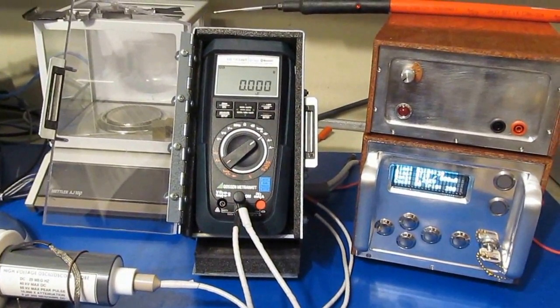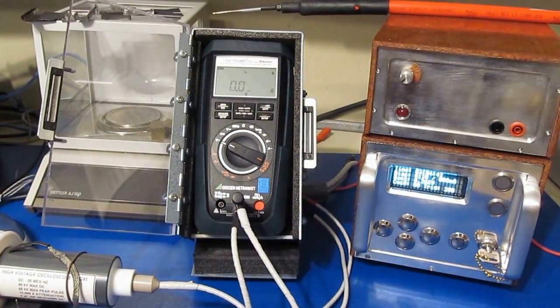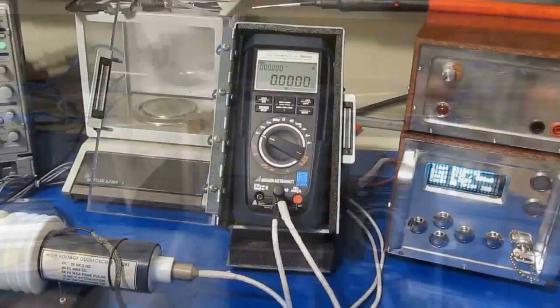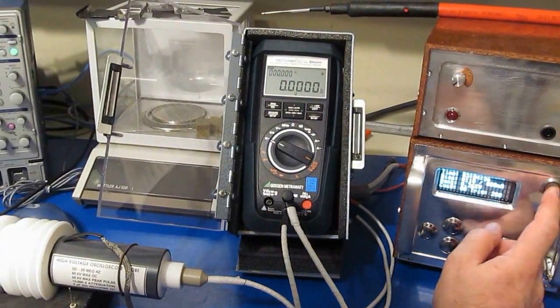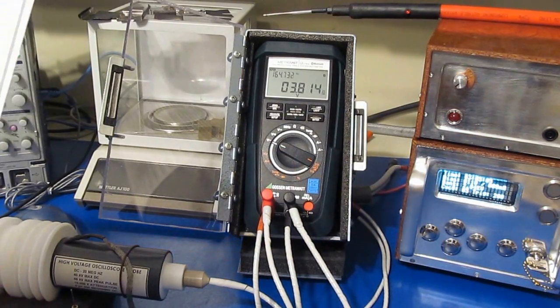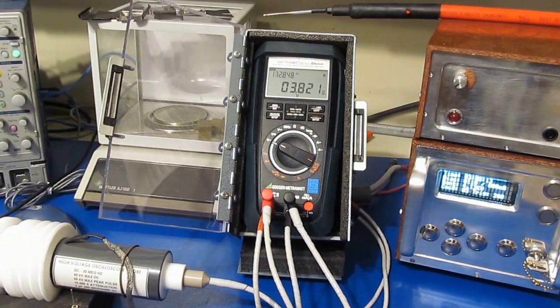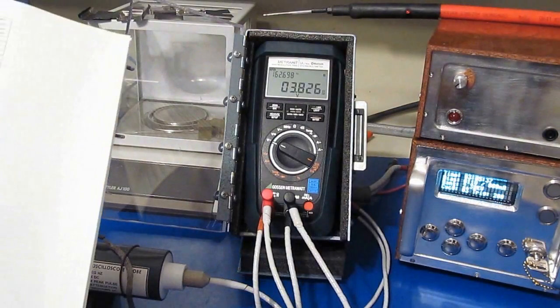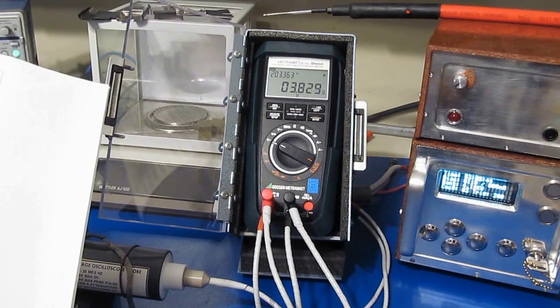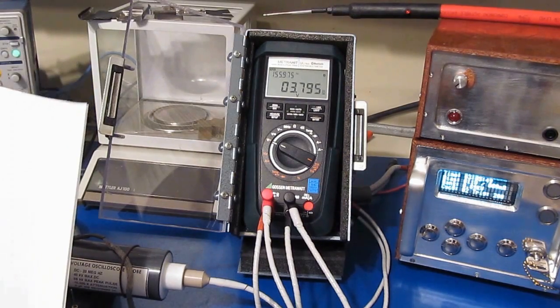The meter passes functional testing just fine. I've changed our generator to put out 5 kV - this is a thousand volts per division and you can see we're up five divisions. We'll be applying five transients positive and negative to the meter, still with a 2 ohm source impedance. It looks like only one meter had failed at 4 kV - that was the UNI-T UT10A pocket meter. Also looking at my data, the Kisuntest KT6000, also branded as the AN860B, also failed that test.